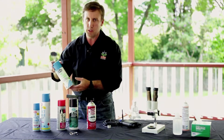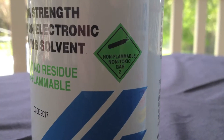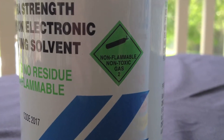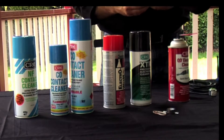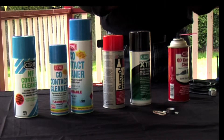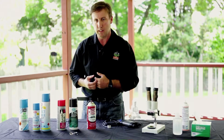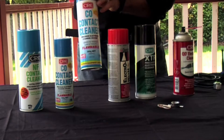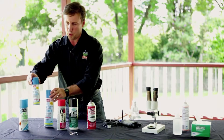Where you need to travel to the field via aeroplanes, choose an electronic contact cleaner that is non-flammable. They still work very effectively, but because they have a non-flammable propellant inside the can, you lose one of the benefits of the electronic contact cleaner. The cans come in different sizes, so you can have a larger one for the lab and a smaller one for the field.